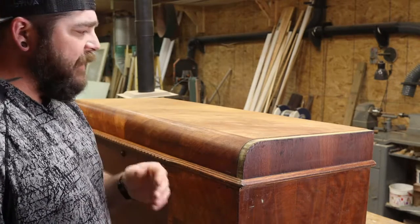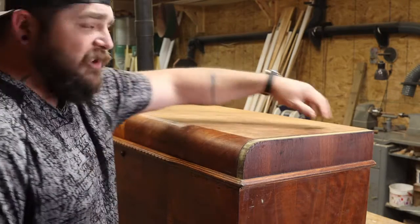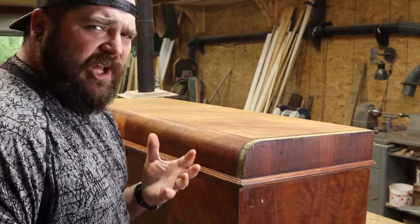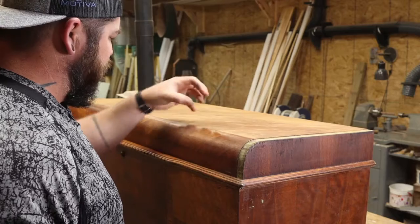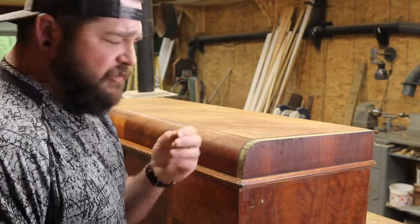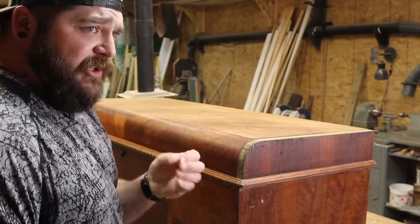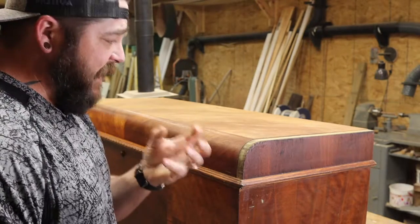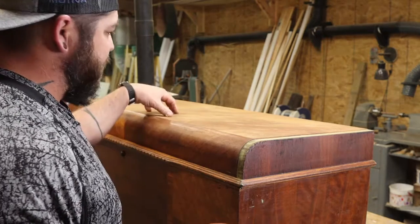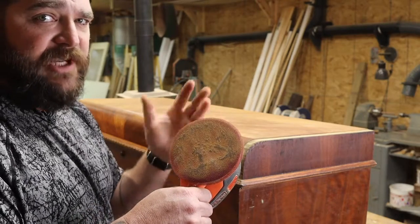It really seems like it's slow going and I don't feel like I'm removing a lot when I remove the sludge from the paint stripper — it doesn't seem like it's really bubbling up and pulling it out. I've tried both the antique furniture thinner watery stripper and the thicker general-purpose jelly-type paint stripper. I'm going to put on another fresh sheet and see if I get even more gumming.